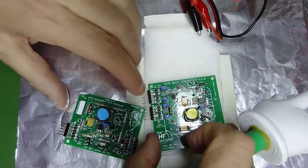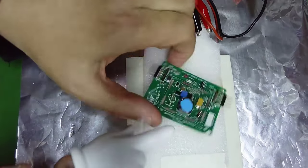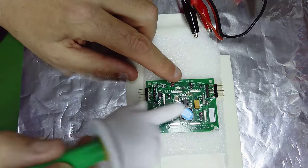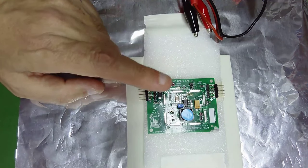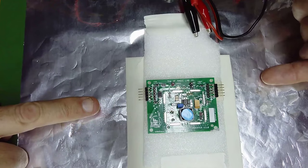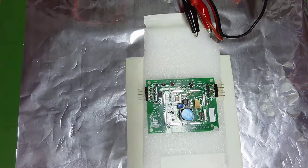Another strategy is to do this. It's the same circuit, but what I am doing is to put the input voltage here and the output voltage here. So they are in separated areas. This can have problems in radiated emissions because with the cables here and here, you can create easily a dipole. But considering all the risk and your system, where the connectors go, you can solve many problems. But you know that sometimes solving conducted emissions, you destroy radiated emissions.